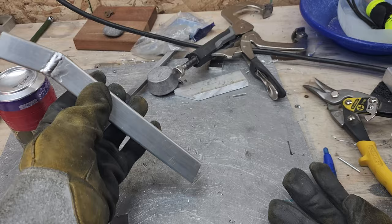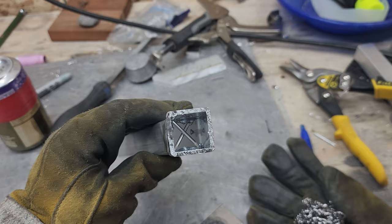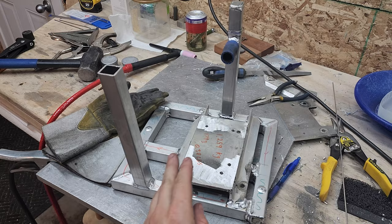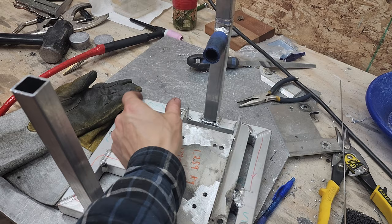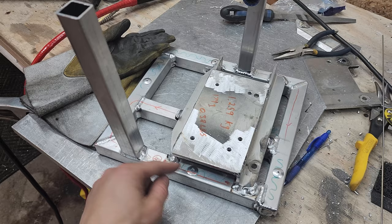This is going to be the vertical for the exhaust. And I've got a couple of welding rods I put through there, and I'm gonna stuff this in there and cap it. Just about ready to throw the engine on permanently here. So just to recap, exhaust goes in here, down here, as the sound waves go in both directions. Here's a chamber with that steel wool to collect the sound, then goes over here, steel wool chamber, and then the exhaust goes across there, another steel wool chamber, around here, steel wool chamber, and it exits up here.